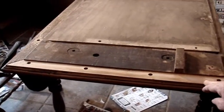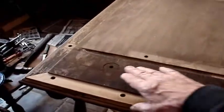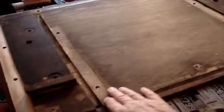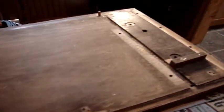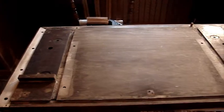When I do the staining on this machine, I'm going to have to stain and color the top coat dark to try to get it to match up in color. This is the only thing that's really going to show when you open up the side doors where the record albums go — I'm going to steel wool it a little bit and top coat it. All this veneer was warped and fell off practically; I've pieced it together and glued it as good as I could with clamps and weights. I think I did as good a job on this base as anybody with my skills could do.